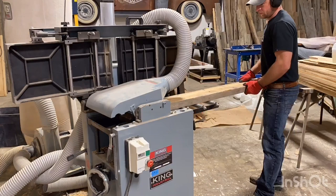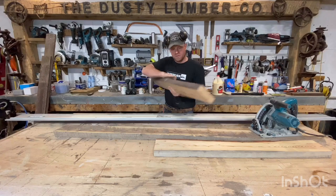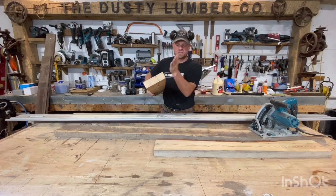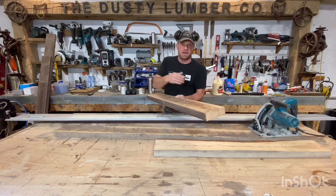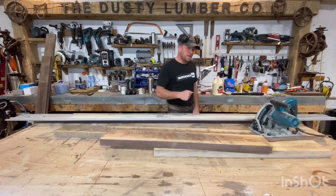We've got all the boards at a uniform thickness. I've preserved some of the saw marks and character on the top, which is great. Now I want to straighten at least one edge out. These are going to sit on the outside of the plywood and you're going to be able to see the outside of the board. We're going to be cutting a rabbit cut out of this, so I want a really straight line that's going to be on the inside of the table for other boards to butt up against. I've cut the track side, measured back five inches from the edge on both sides, set the track in, and cut the line straight.